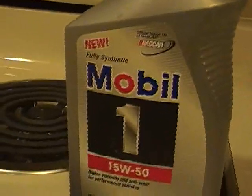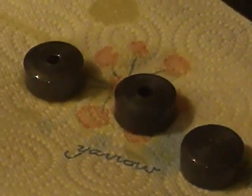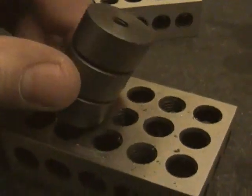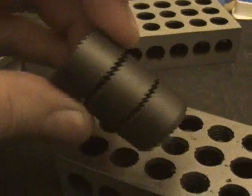I'm just going to use a little bit of Mobil One 15W50 because that's just what I had in the kitchen. I put a very liberal coating of oil on them — just kind of rub them down all over with it. It's pretty thick right now; we'll let it soak in for a minute or two, wipe it off, and go ahead and assemble the final piece. Here's the final product. It is nicely finished — the parkerizing turned out pretty good, and overall it's not a bad looking piece of work for just having taken a few minutes to make it.